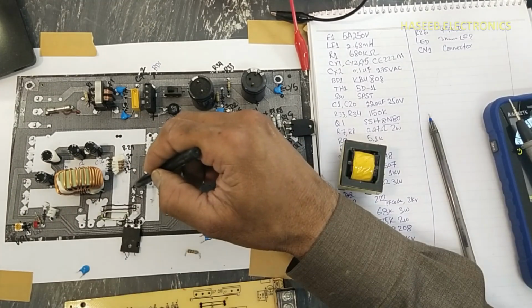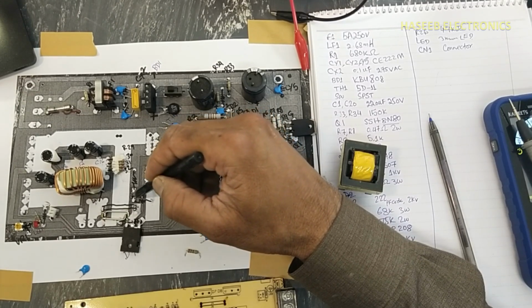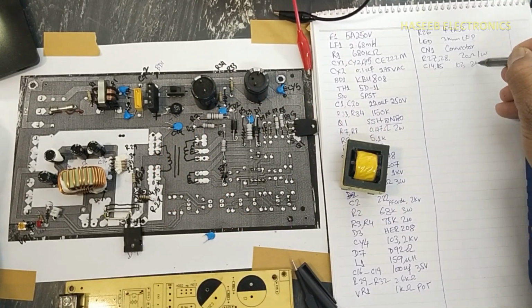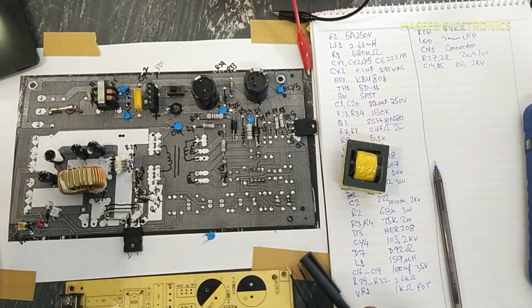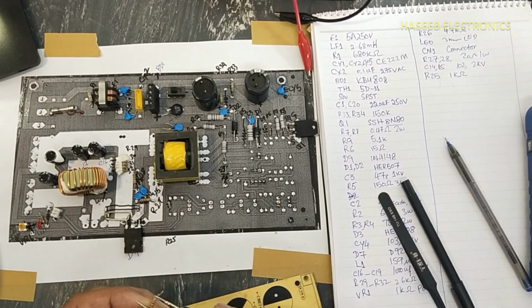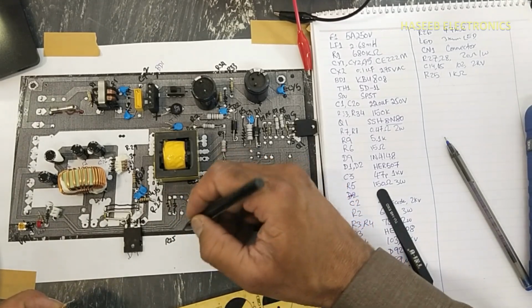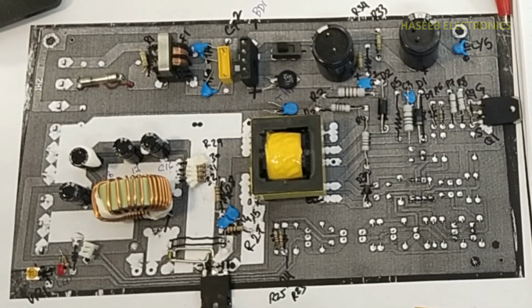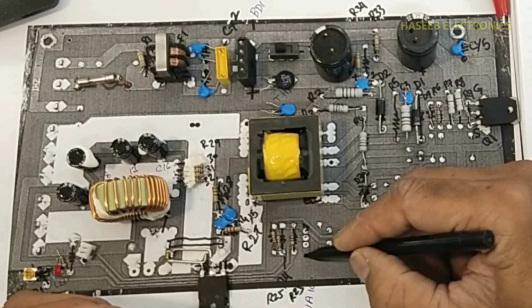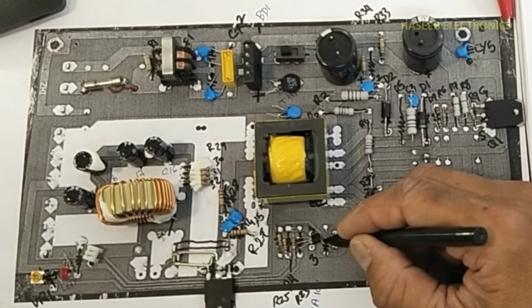20 ohm. One resistor here. Second resistor here. One capacitor. Second capacitor. 102 2 kV, 102 picofarad code. This 1 kilo ohm resistor, 20 kilo ohm, R24, R23, 2 kilo ohm, TL431A, pin number 1 here, 3 here, center is ground, 5.6K,